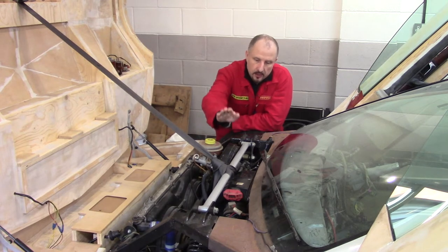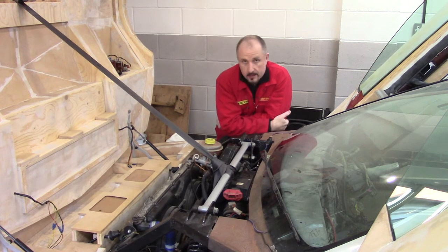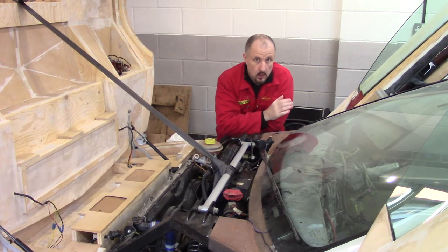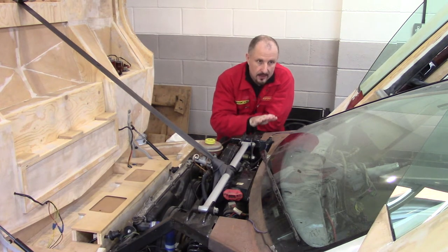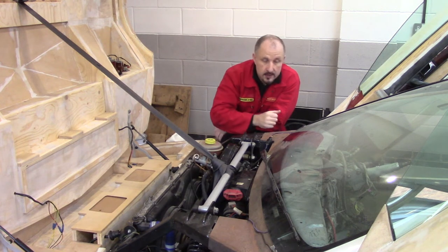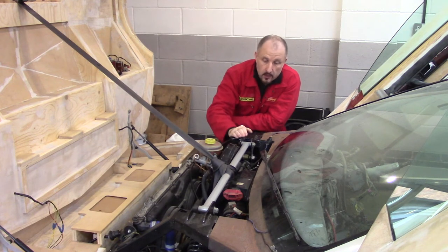If we take a closer look at the prototype braking system, you'll notice that there is a servo, or booster. I wanted to retain that from the original donor car and transfer it over to mine, because at the end of the day this is a supercar designed for road use. The servo helps with braking, and this one is activated via a vacuum created from the engine. It's hooked up and works just like the original donor car.